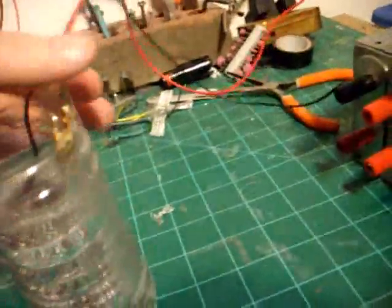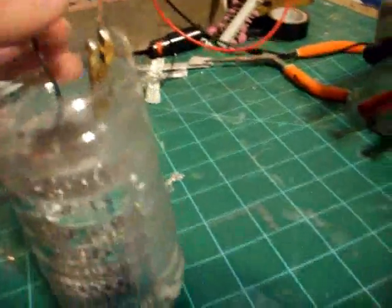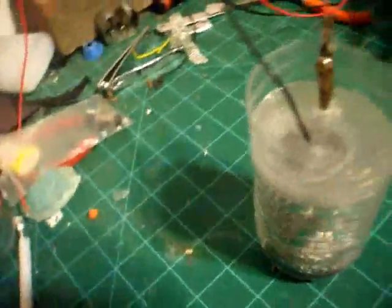Alright, I got beta hooked up here. Let's look at the core. It's got an inner lining of copper, outer lining of aluminum. So I got some little mesh project stuff here. I'm hoping this will be a little bit of an improvement. At this point I noticed that the water was getting kind of crusty, and I realized I should be doing some more research on this. I should have done research before deciding to do all these little experimentations. The problem is I have aluminum and copper as my anode and cathode, and those deteriorate with electrochemistry.